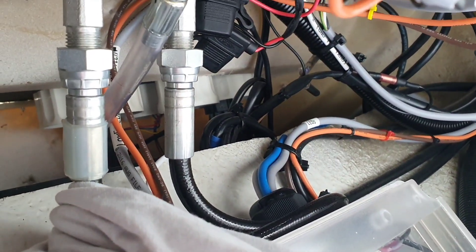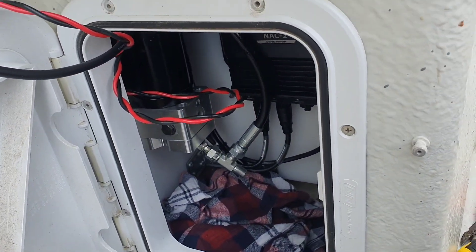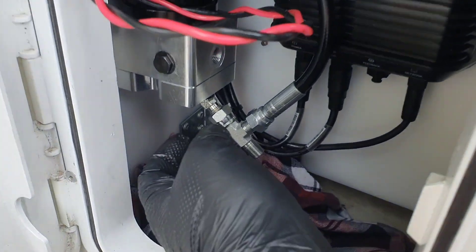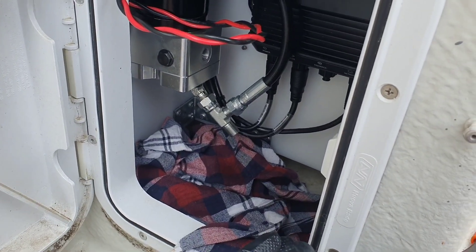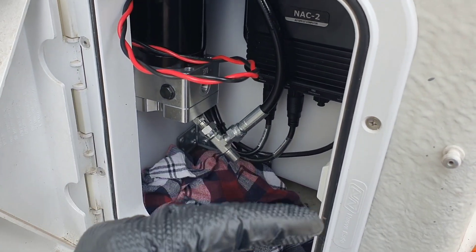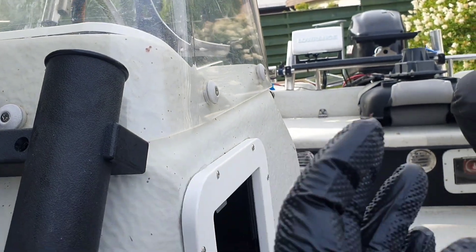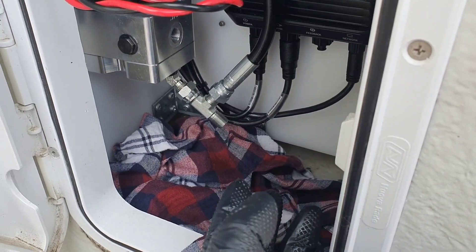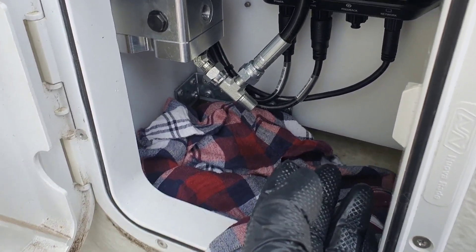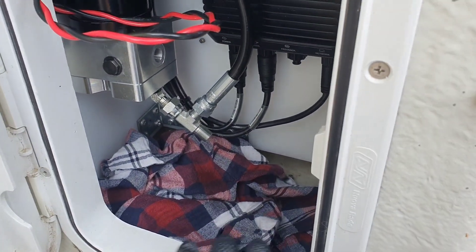These hoses — I want to make a 45-degree angle there, because the hoses going to the helm are original NITAMO Japanese and quite bad. If you watched my previous videos, you have seen — they're extremely bad. And that's why, to avoid bending, I wanted to make 45-degree angle fittings there. It would actually be good to change them to good reinforced hoses, but that's quite a big deal. So I will have 90-degree here and there, unfortunately. But that's what I have.